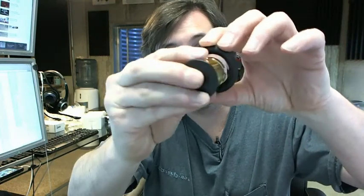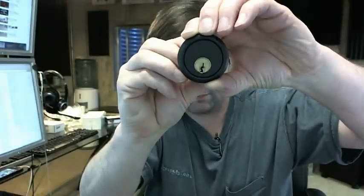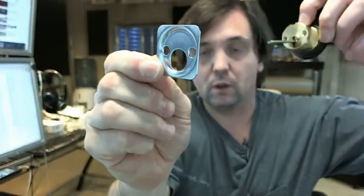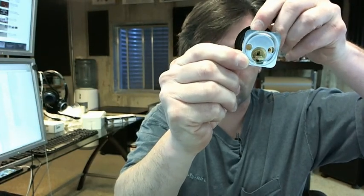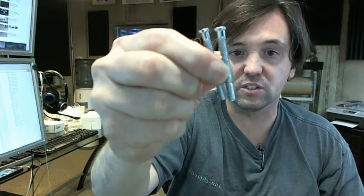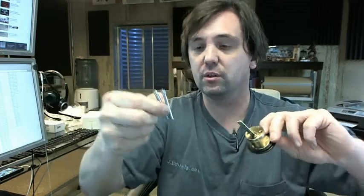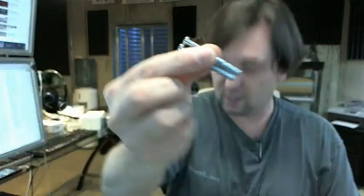With that you are going to get a cylinder collar, so it will look like that when it is installed. You are going to get the mounting ring or retaining ring which would go on the back of the installation. Then two screws, breakaway style screws for different thicknesses of door, as is the tailpiece — you would cut those to length. Generally that tailpiece is going to work for inch and three quarter doors, although sometimes the screws need to be cut down.